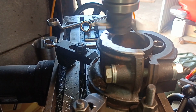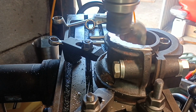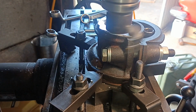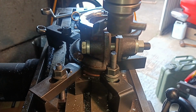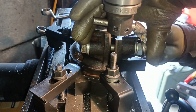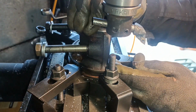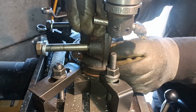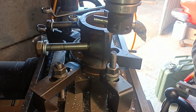I'm winding over there because I want the back side of the cutter centred up. Probably can't see it from where you are. So now I need to take it out, turn it round and put it up the other way. Can you see how the bearing is slightly out of the thing? It's rotated because the tang is this side, on the housing, on the main cap.